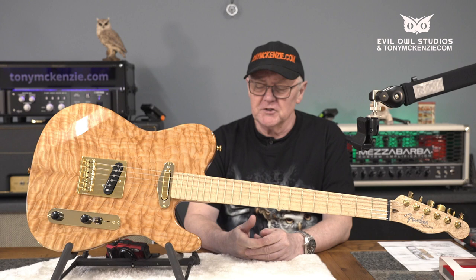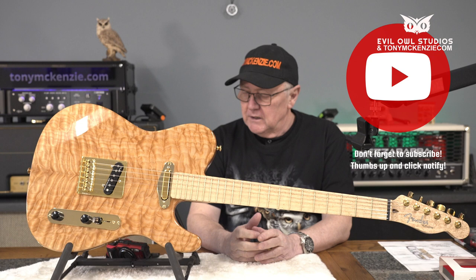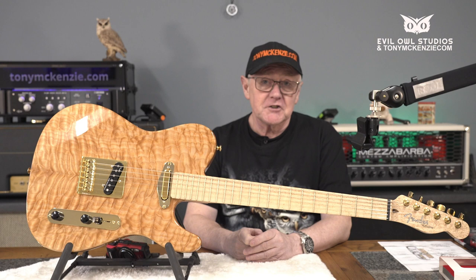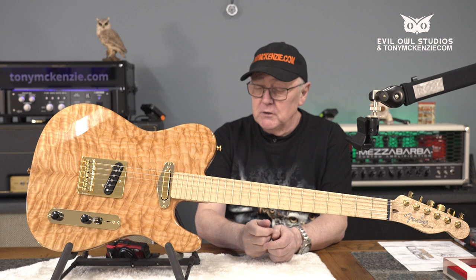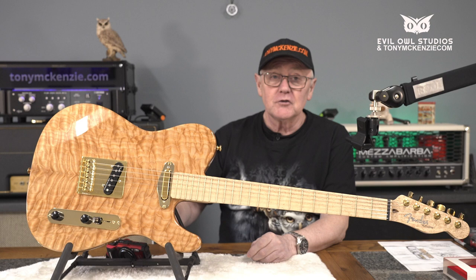And that's essential, because if you don't do that, you're going to be routing the guitar out. I didn't actually want to route anything, so I kept the guitar as standard a Telecaster as I possibly can. And that's why this little section is on here, because if you've got a standard Telecaster but you wanted to fit the Ultra Noiseless version 5s, these particular ones, well then, you're going to have to do what I did. And if you don't, make no mistake, they do not fit. So you can see them wires there, all soldered to the top of the pickup rather than underneath it.